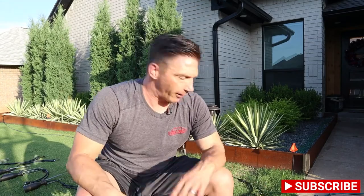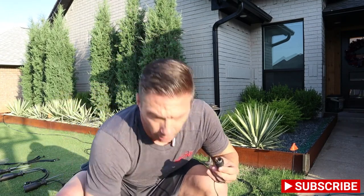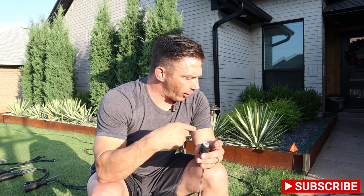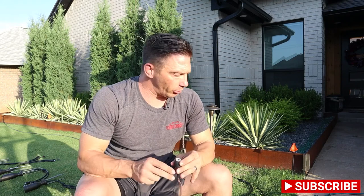There are so many types of lights — you have your typical up lights and down lights, tree lights, and what are called niche lights. Niche lights are a single specialized light with caps made to be flush-mounted into whatever surface you want — concrete, decks, multiple surfaces. They're super cool. It's a one-piece deal with the light already built into the fixture. You just choose what kind of ring or trim you want: brass, copper, white, or silver. We have a job coming up where we're running a bunch of conduit into a concrete pad around seating areas near a pool.